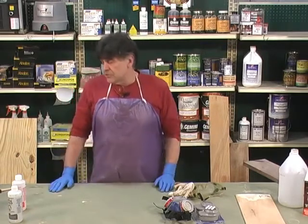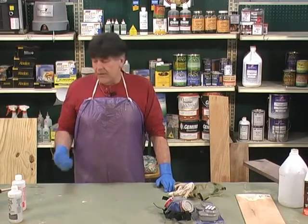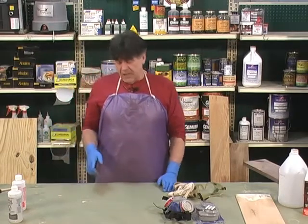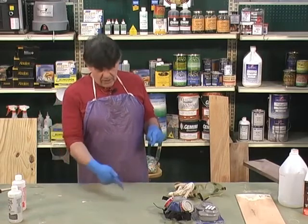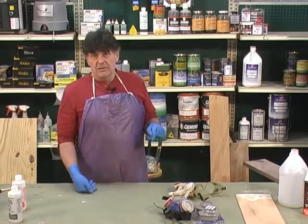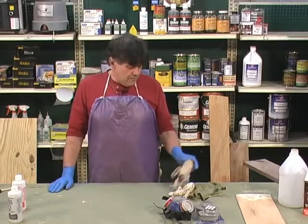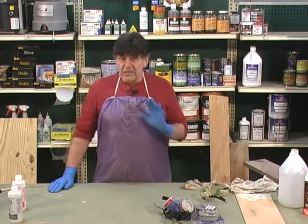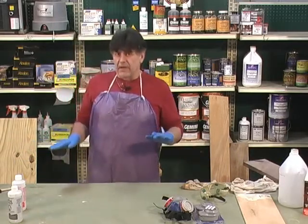It helps us to control and eliminate color. The other thing the oxalic bleach will do is that a lot of times if you've got a piece of wood that's set on the floor or something and gotten wet and you've got water stains in it, the oxalic bleach will help take that out. Now, here's my progression. Here's the way I do it,